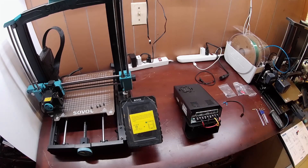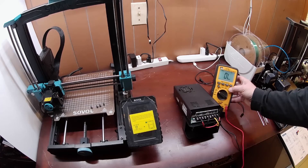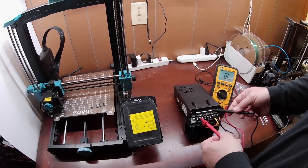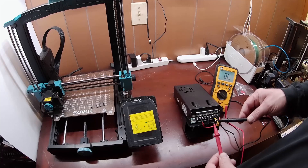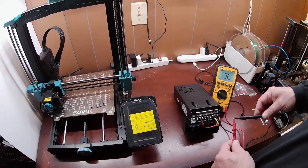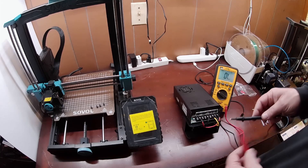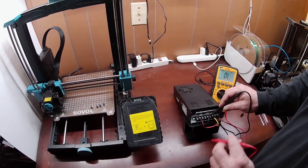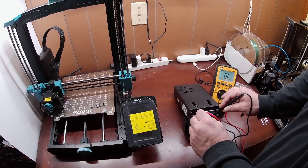Now to do that, I've got my little test meter here. I'm just going to turn this on ohms, turn that light on. Hopefully you can see that. And whenever you have a connection — a complete circuit made — this thing is going to let you know. And you can see that when I do this, it makes that beep, lights up, tells me that there's very little resistance there.